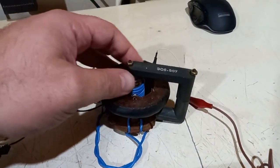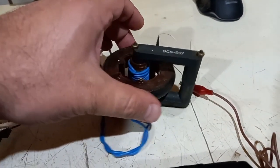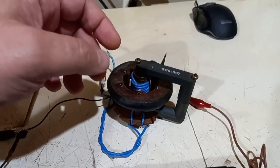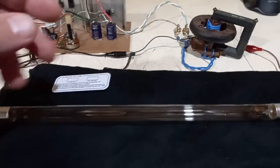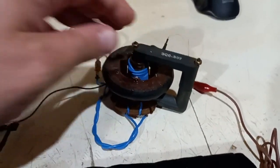What do you need for this experiment? You need an SMPS flyback — this one is from a tube TV. It's capable of being driven at high audio frequencies and up to 20–30 kV maximum, but we don't need that high a voltage, just maybe a couple of kV. Any flyback, even hand-wound, is perfect.